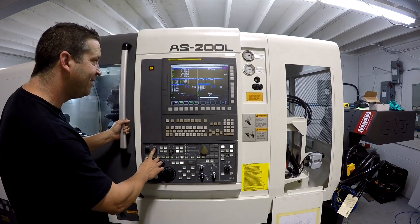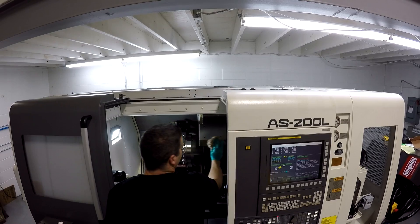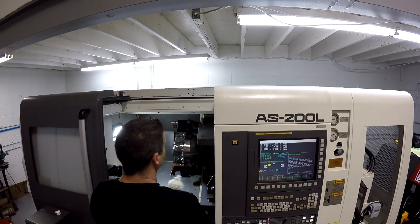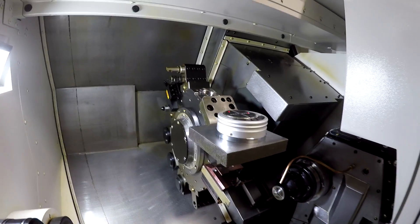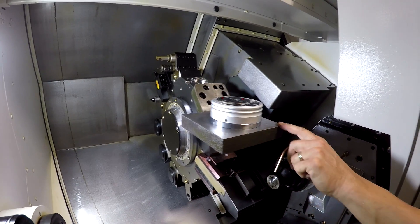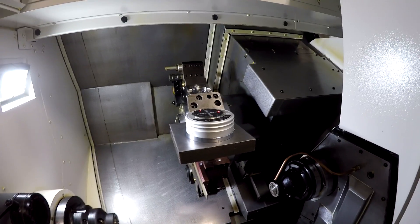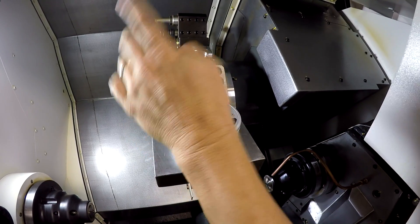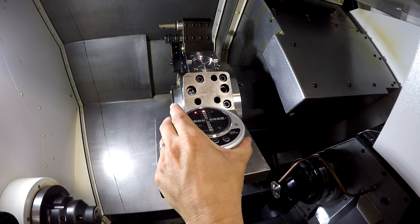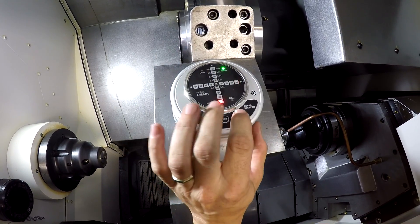It's alive! So you bolt it on like an angled tool holder, basically. You have to indicate it this way, because you can move it on the bolt. It might be less than 10 microns — that's pretty tight. And then it just tells us it needs to come up in front. This is only the low setting. Then when you get it closed, you switch over to high, and then it's perfect.